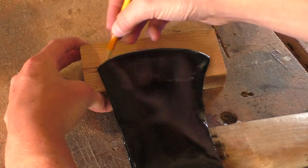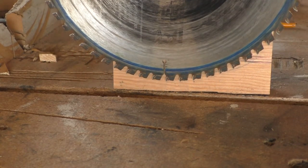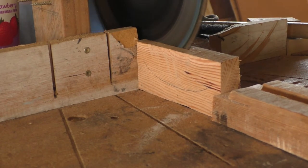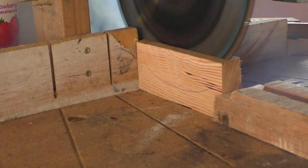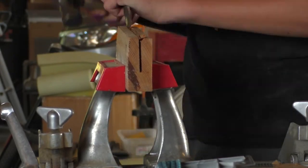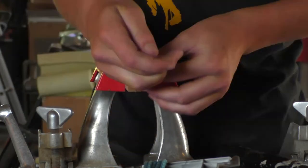I'm going to start off by measuring how much I need to cut into the wood, and then raise the blade on the radial arm saw to cut it. I then begin to use the chisel to hog out some wood so I get a more wedged shape.